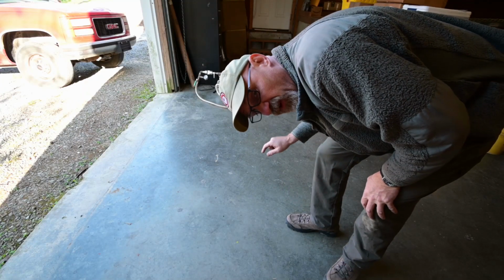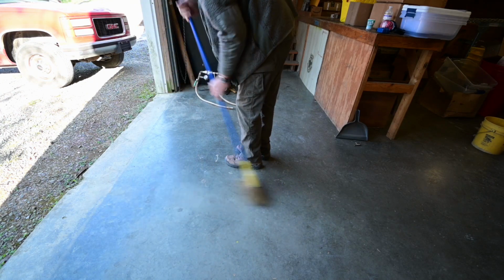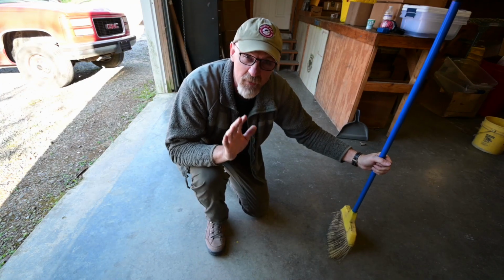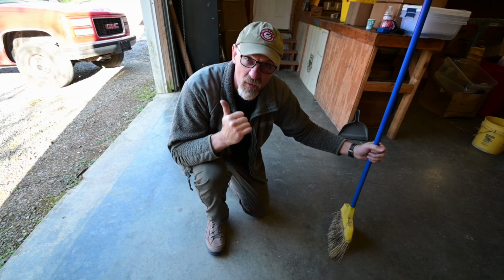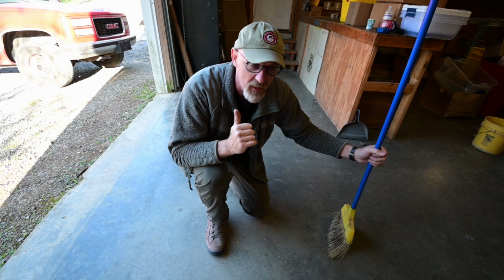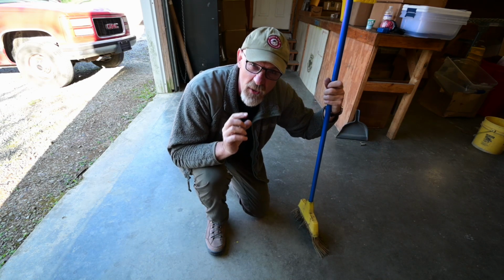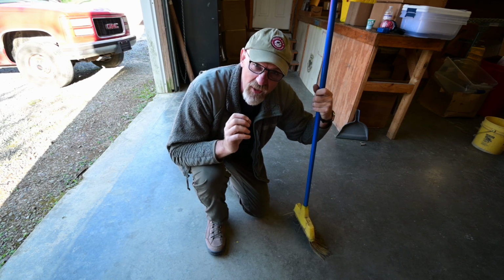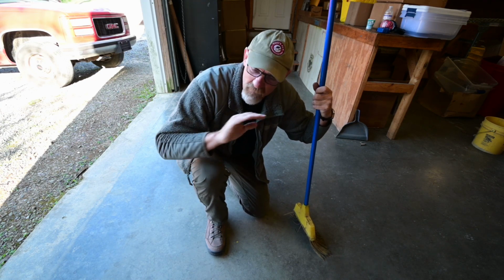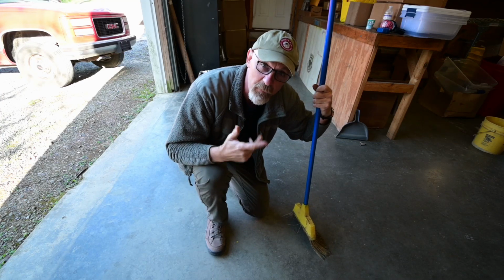First of all, the floor needs to be clean, so let's sweep the floor. If you have a machine shop, never ever sweep the dirt out the door, because then it puts it in your driveway. What do you make in a machine shop? You make little metal filings, little chips as they call it. They're very sharp. Guess what else is in your driveway? Your car tires. Not a good mixture. Always sweep the chips into the shop and sweep them up.